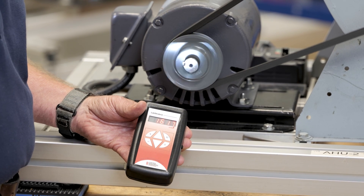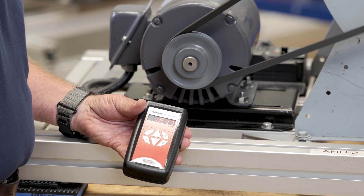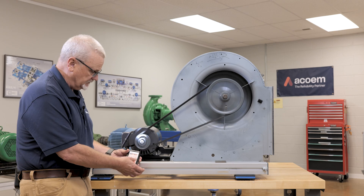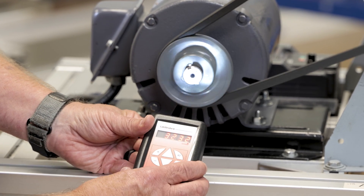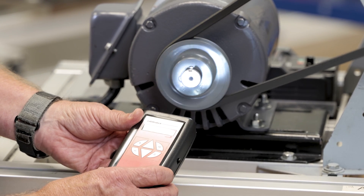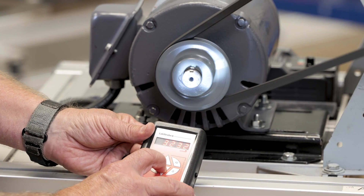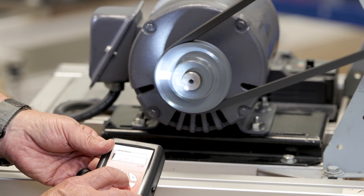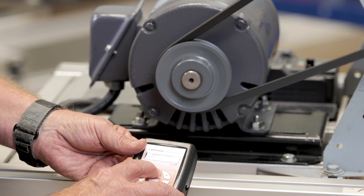Now when it flashes, it looks as though the shaft is still or almost still, and that is 1617 RPM. How do you know if it's running speed or two times or four times running speed? If I double the speed, you can see it looks like this shaft has two keyways. If I double it again, it looks like it has four keyways. So find a reference mark — whether it be reflective tape, the shaft itself, or a keyway — some reference that there's only one of per rotation.